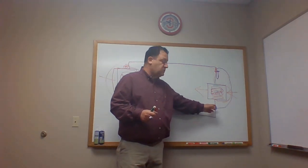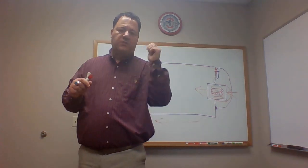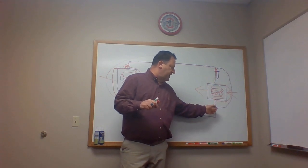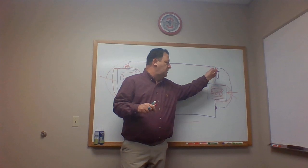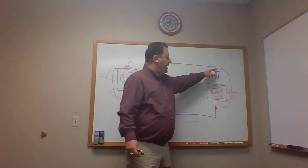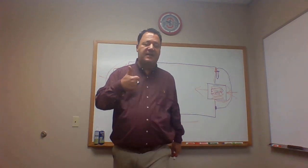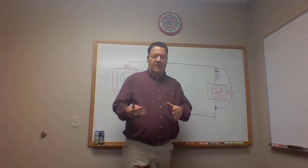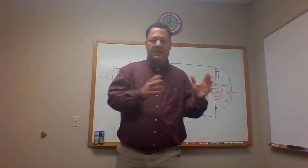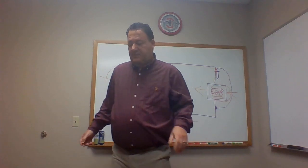If this is superheated vapor, it gets warmer, which causes the refrigerant inside that bulb, which by the way does not interact with the rest of the system, they're not connected, it stands alone, to get warmer. As it raises the temperature, it raises the pressure in that tube, going back to the top of our TXV, pushing down on that diaphragm. It opens up the diaphragm, allows more liquid to come through, okay? This gets satisfied and says, yeah, I really like that, that's not as hot as it was. But it's constantly adjusting. Think of this: a piston and a cap tube are fixed holes. A TXV is just a moving hole, adjusting on the load conditions, all right? Okay, that's what it is.